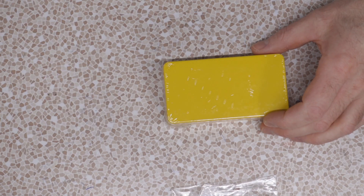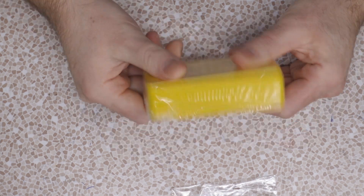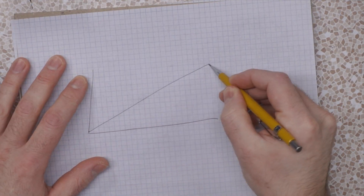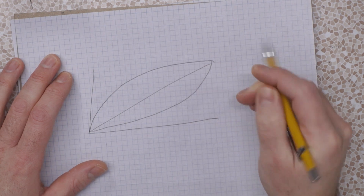For other components: we have a bog-standard $12 Hammond enclosure, just big enough to fit a 9-volt battery. I got yellow, so it's kind of true to the aesthetic. The pots are really interesting — these are TT Electronic P0925 series. The circuit calls for a reverse audio taper, not a normal audio taper. A linear pot goes linearly, an audio pot has a log curve, and a reverse audio pot curves the other way. Reverse audio pots are rarer, and I feel like I was lucky to find one in the size format I wanted.